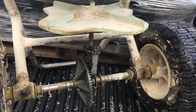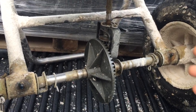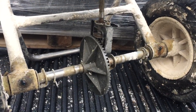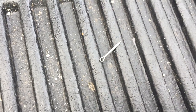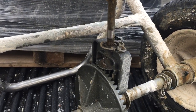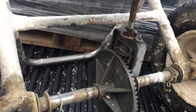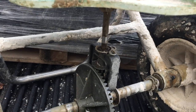...it probably has something to do with what's going on down below, sort of the gear contraption here. I've taken a casing off of this — you may not have this kind of spreader, but most spreaders have the same kind of mechanical design. What has happened is that little clip there, which you can kind of see, goes right in here — try and spin it, see it right there — it broke off. When I put the replacement clip through, I kind of opened it up and only put one of the prongs through and then wrapped it around, and it ended up actually breaking again.